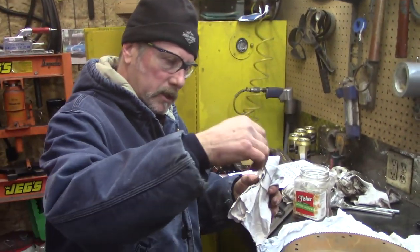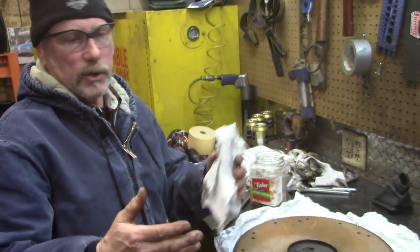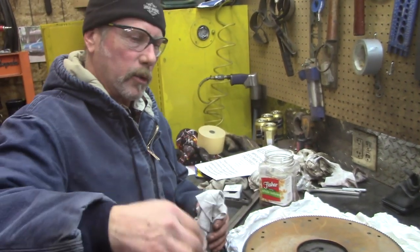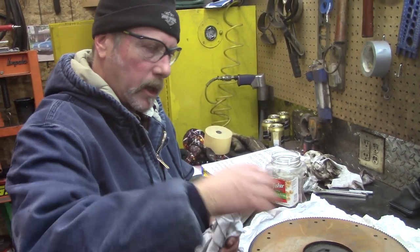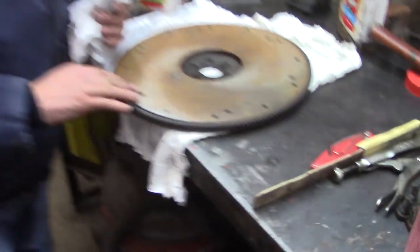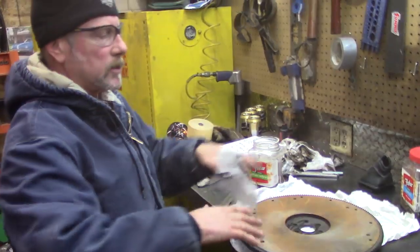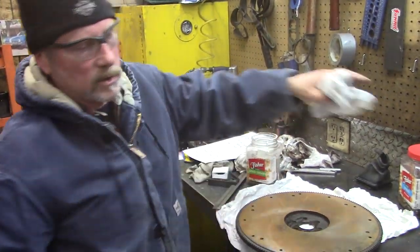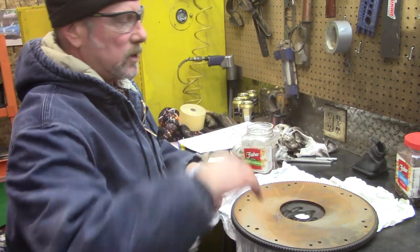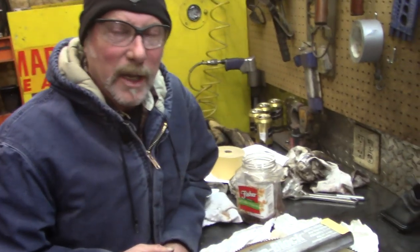Sometimes you'll have a machine that has a bunch of fly cutting — you'll see that on the surface of the head where the cutters are coming by, and you'll have these half arc patterns. This I think they call blanchard ground. There are lapping tables where you put a part on and these things all turn in their own circles — you can lay something on it and it lays it perfectly flat. The thing sat around and got rusty.